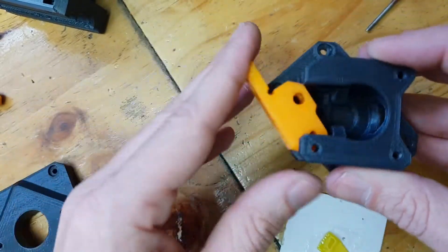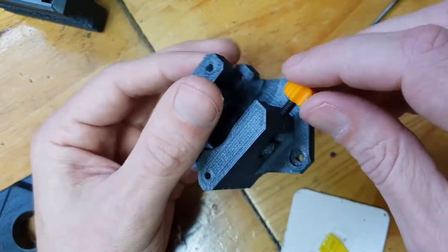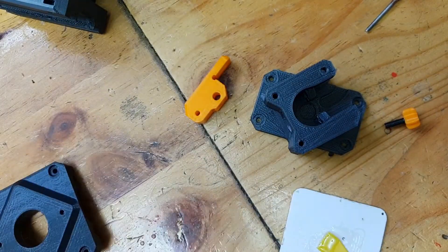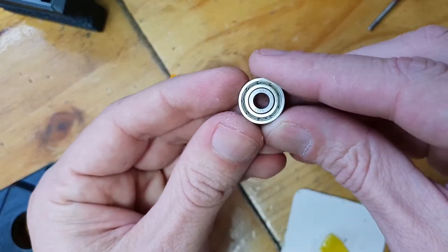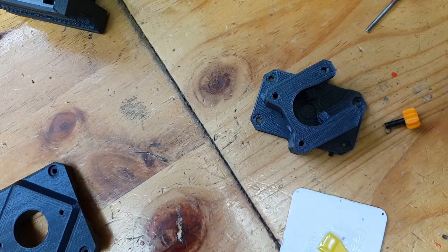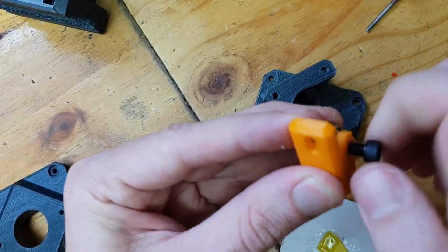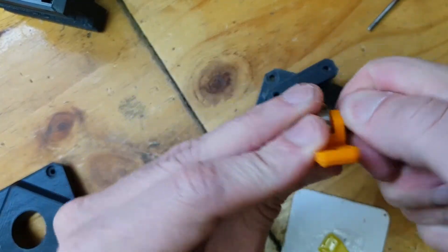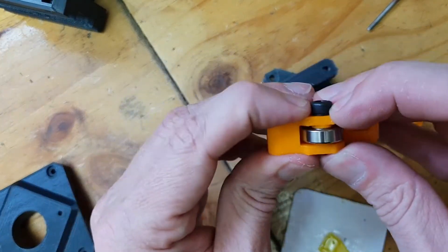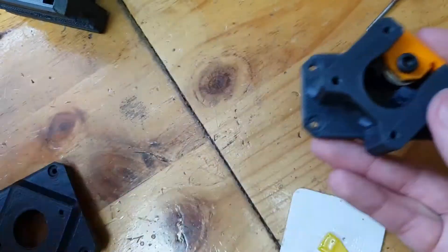This also serves as a tensioner to tension the filament onto the motor extruder gear. There's also a bolt that will basically compress the door onto the filament. You may have to put in a little spring so it's not a direct press — you'll see that the door has a little gap in there to sort of weaken the plastic. We use a 625Z bearing that will basically just slide into the door, and then there's a five millimeter bolt that threads in. On the sides of the bearing there are two little spaces that are part of the inspection door, which allow the door not to squash the bearing so it still spins freely.